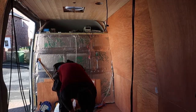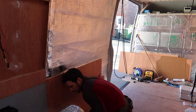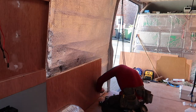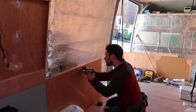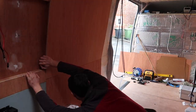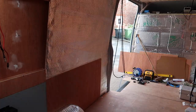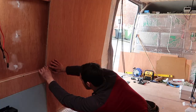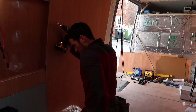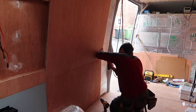One final thing: as you can see, where the bottom boards finish is where a long structural member runs the full length of the van with no breaks, sitting at around 700mm on my van. It's also where the wall starts to curve up toward the top, which prevents the board from having to bend and creates a natural break point — keep an eye out for that.